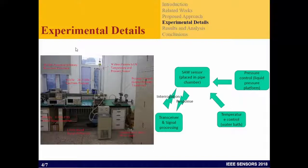The student conducted experiments at Harbin Institute of Technology, trying two setups. One is testing in air — how these sensors wirelessly sense pressure using air pressure changes and temperature changes. The second setup uses a small glass pipe — actually two pipes together with air in between. You can fill it with air or water, with the small SAW sensor on top not touching the water. That is another issue: it cannot be submerged. We verified the performance of these sensors in both setups.